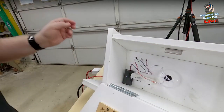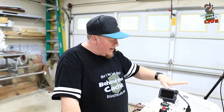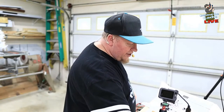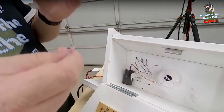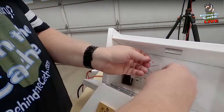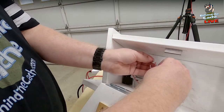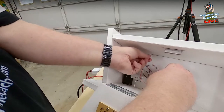Y'all don't need to see that part — it's just maintenance. Then I'll put this back out in my backyard and go out there and test it off and on throughout the next month or so, to give me some idea of how it's going to do with weathering. I did do this out of PVC boards so I'm not too worried about the weathering — it's not going to expand. I just want to make sure those reed switches are going to fire every time I move that arm and that it's going to be perfect whenever somebody comes out. So that's why I'm doing that. Using solder sleeves is really great, especially for those of you that are uncomfortable with soldering or have never really soldered before — this just makes it really easy.